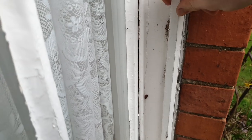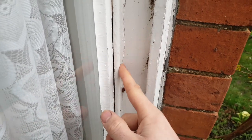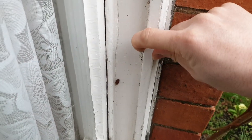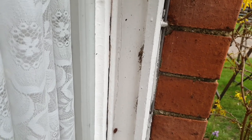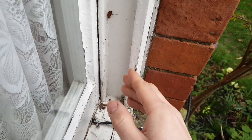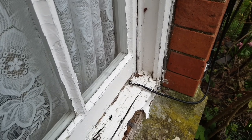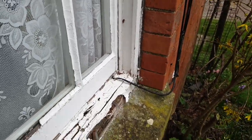You also want to scrape the paint off on the outside sash groove — from the outside casing to the parting bead — so you get back to wood and measure that gap, because you can't change it when refurbishing. It's determined by the parting bead to the casing. Measure it in a few places and also measure the old sashes. These casings can move away from the pulley stiles, or parting beads may not be seated properly. If you make your sashes too thick you'll have a job trying to fit them and will need to plane them down, so that measurement is quite critical.